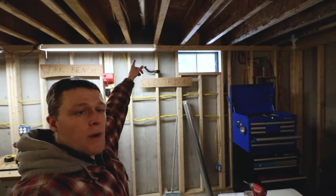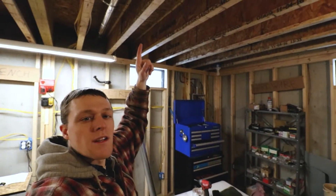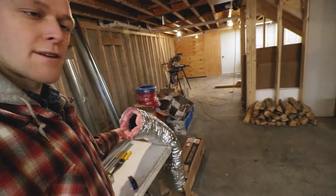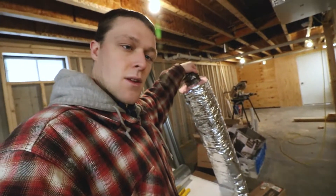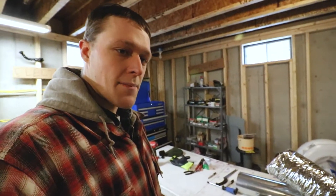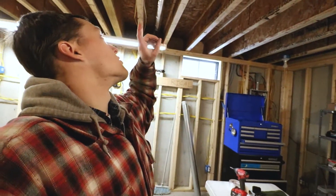In here is where the intake air comes in through this four inch duct. I need to finish insulating it. I've got this insulated flexible duct — it's a corrugated plastic with pink insulation around it. I'll probably end up using that because I have enough left over. I may rip out that tube on the inside and just do that quick section I have left to do.